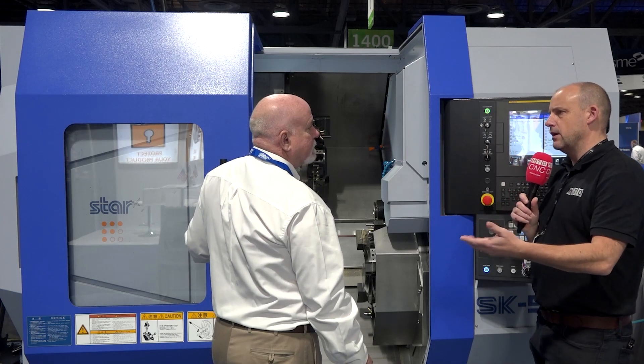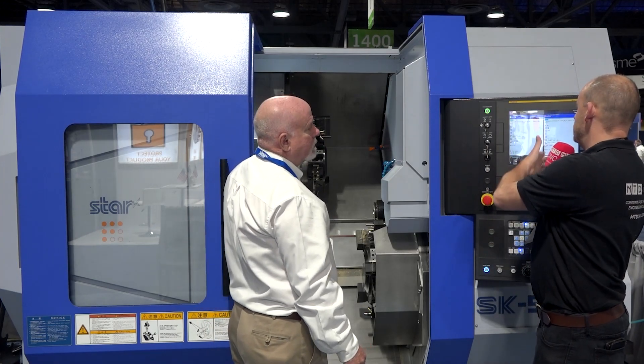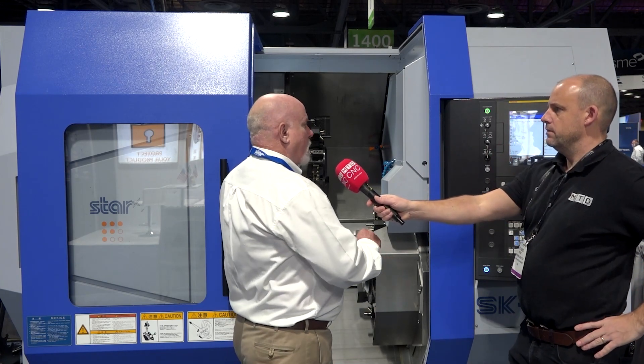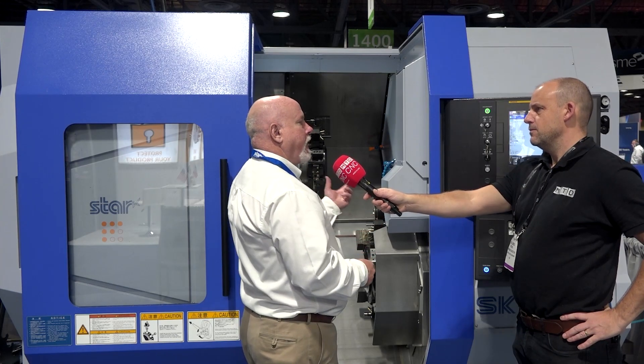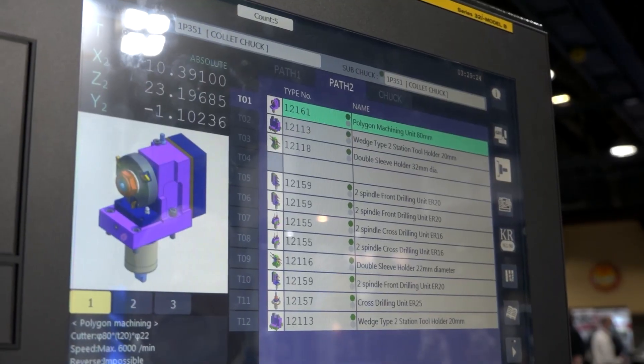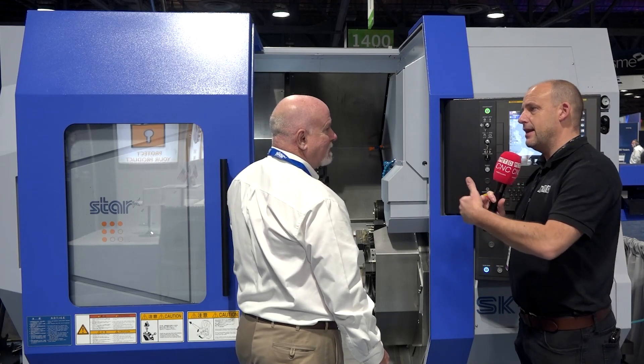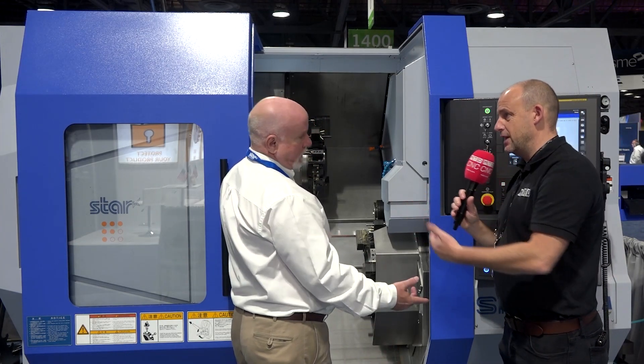How would you go about programming something like this? Because I see here you've got two sides to the screen — is that just dictating that you've got spindle one and spindle two? That's just head one and head two, or path one, path two as they call them — so it's a two-channel machine. The way you program is just like any other XYZ type machine. When you go to two channels you just have to time them with wait codes, sync them up. You've got to determine which one's going to run, which one's going to stop, and get them to dance together. You've got to balance things out as well, otherwise you don't really get the benefit of these machines. Exactly — you almost have to run through one first, and then you'll see where you could be doing this while that's running to shorten your cycle time.